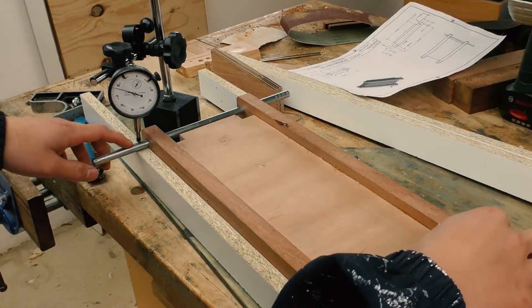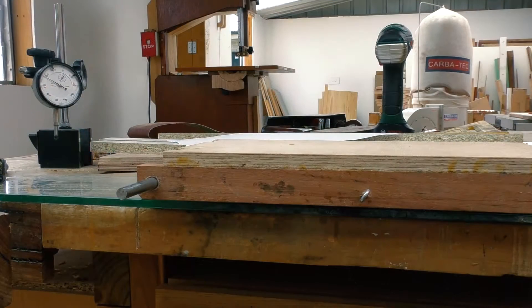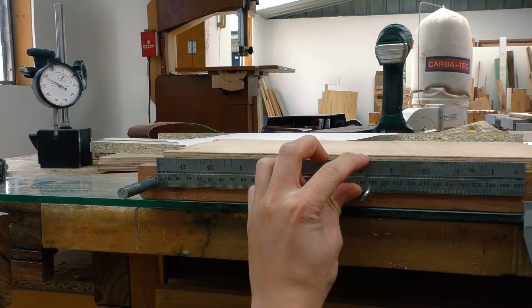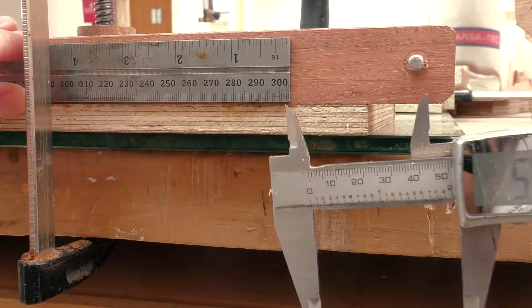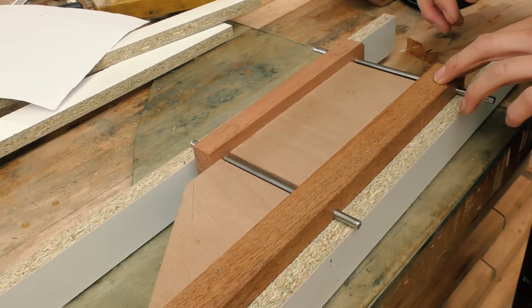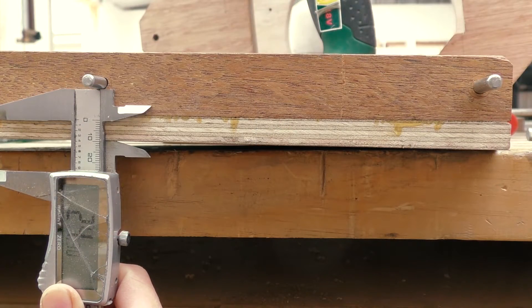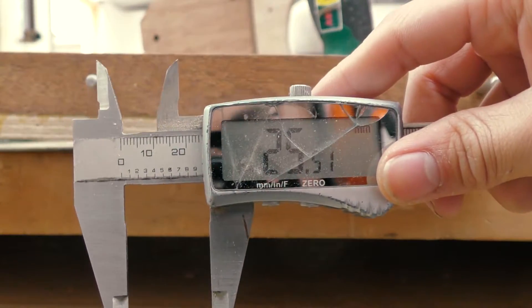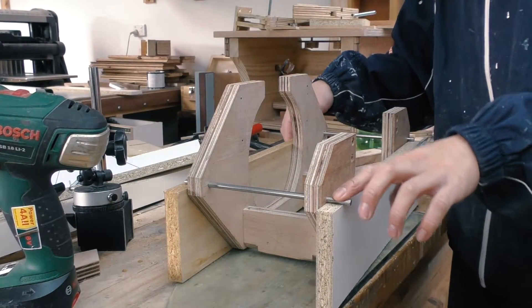Now checking the long link — this one seems to have 0.02 millimeters of twist, and I think that's small enough to ignore. Now checking whether they're at the correct distance apart using my ruler in combination with my calipers. I think I'm 0.3 of a millimeter off and that's good enough. Checking the other side — this seems to be just perfect. Now testing the operation link, and I think I found where the error came from: one millimeter of twist. That's unacceptable. 24.3 and 25.5 — that one definitely needs to be re-drilled.